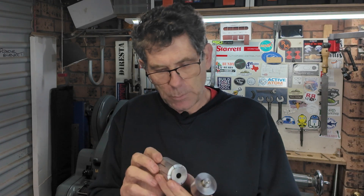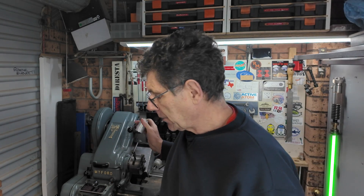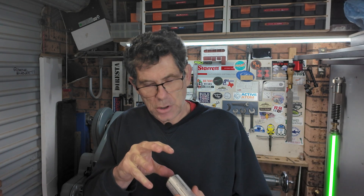The trouble we have is that we've cut slots into the ends of the lap and at the moment they don't go all the way through to the core, but when we cut the taper in they will. If we're not careful it will distort and change size. We need to be able to hold one end in the three-jaw chuck and squeeze down on it without it squashing. Once we take away that centre core the three-jaw chuck will squash it because of these slots. That's why we've machined in these rebates in the end.